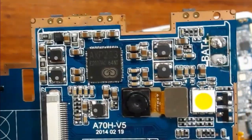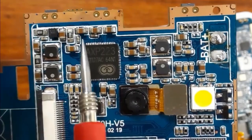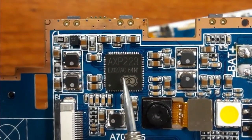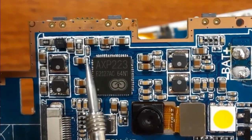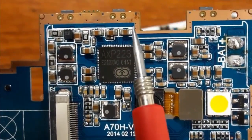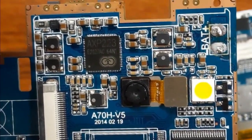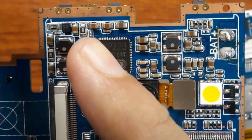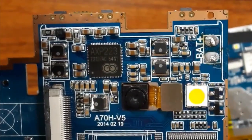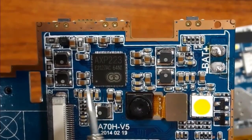As you can see, for every IC in the motherboard it is surrounded by many components — specifically many ceramic capacitors. The question here is: how can we check the serviceability of this IC? Because we have a lot of pins, you can check it using two methods: you can check the pF capacitors around it — if you find a shorted capacitor, it means the IC is shorted and you should replace it — or you can check the heat using your finger. If the IC is very hot, it means it has failed. I will show you right now how to check the IC by checking the ceramic capacitors around it.